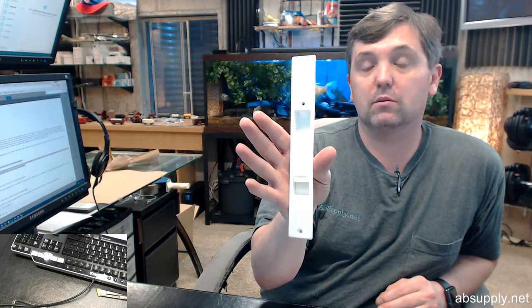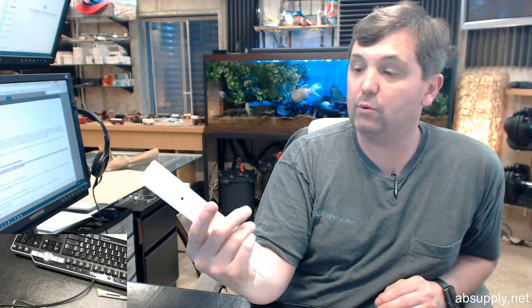There is, below this video, a link to the product catalog, which is very handy because it will allow you to review the entire lock that this interior escutcheon comes out of, and that would be a 4430 or 4431 series sliding door lock. It will also allow you to build the entire part number as if you were going to order a lock. The next link is to the installation instructions. That's obvious what it's going to be for. Very simple, quite frankly. You've got two countersinks here, here and here, for screws, the exterior, the interior, the screws, a lock body if there is one.